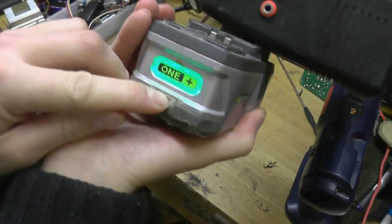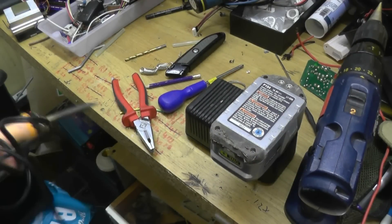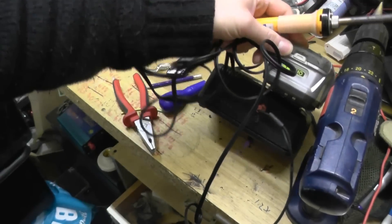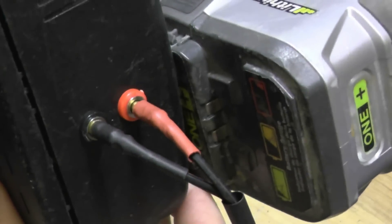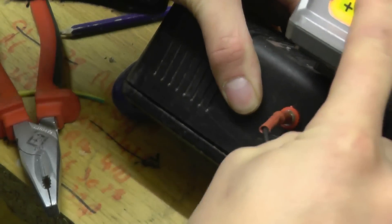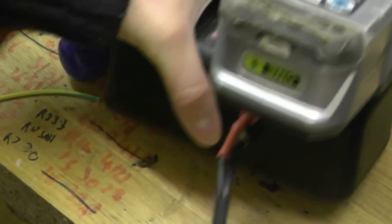The blue light shows it's on; this is just an old battery showing green. I don't think it's too bad to be honest. I'm just going to use it to run my soldering iron for now using the two banana plugs. They're only little cheap banana plugs so I wouldn't really put 16 amps through them like I would with a better quality one. It's certainly warming up slowly and it's gone to orange — that better shows the draw, as in as soon as you put anything on it it runs the draw for 10 seconds then it goes down in colour.